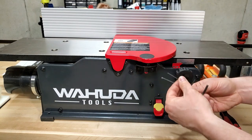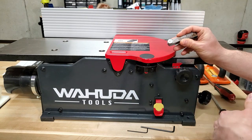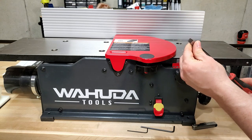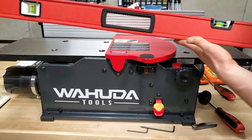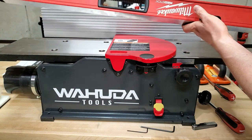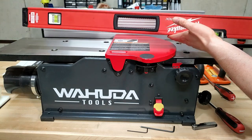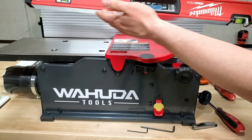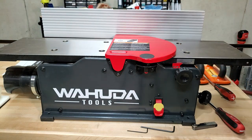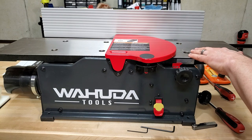To do this setup, you'll need both Allen keys that come with the jointer, a set of feeler gauges — pretty cheap, usually under ten bucks, I'll put a link in the description — a large flathead screwdriver, and a very flat reference edge. I've got a nice level with good references; it's magnetic on one side, so use the non-magnetized side. I checked it against another level of similar quality and it is perfectly flat. You can verify that by putting them together and moving them along, then flipping and doing the same thing.